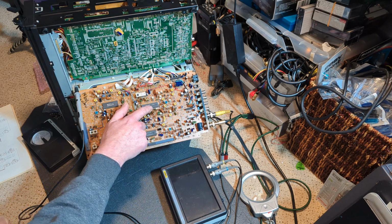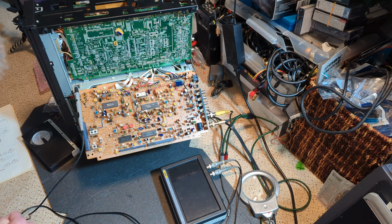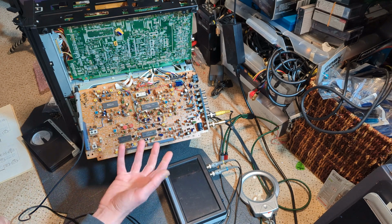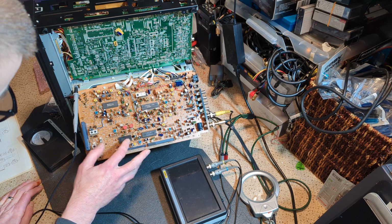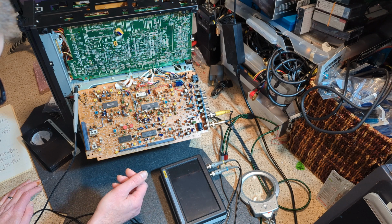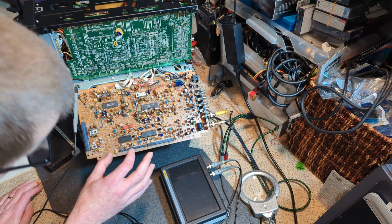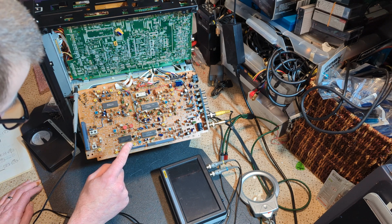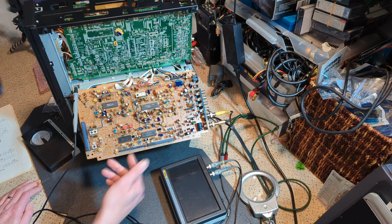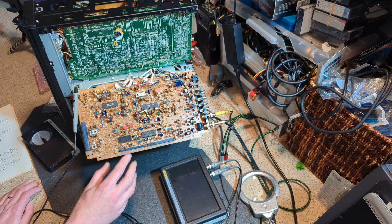What I found out, I actually took off the mute, which I think is still off, and basically I've just got no signal. I've just got a mess of noise coming through, and it's not like clogged head noise. It's just noisy blank video, basically. I seem to remember when I was testing through, the front end where it comes into the board is fine, but from memory, it's pretty early on in the processing that it disappears into just rubbish. So I need to trace back my fault finding from the front end on, rather than from the line in or line out, and see where that signal disappears, where I just get mess.